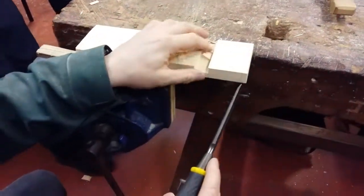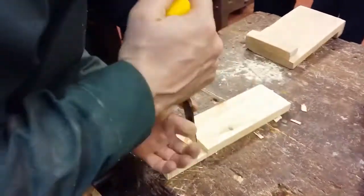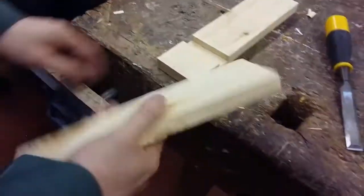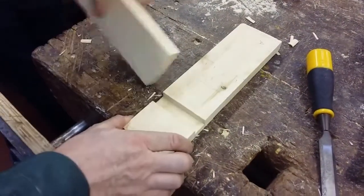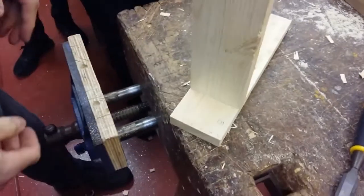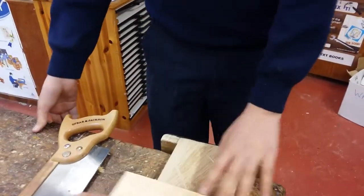I clean it with both hands behind the cutting edge, running the chisel straight across with good control, elbows close to your side so the driving force is coming from your shoulder. With your knee elevated, you can see there are little frays on the shoulder line. To clean them, put your thumb on top of the chisel and work 90 degrees straight down to clean off those little pieces. That leaves me with a clean trench. I can offer a separate piece into it to see that it's fitting in nice, close, tight, and square with no gaps along the edge.